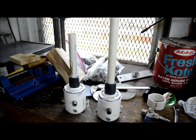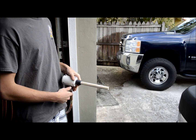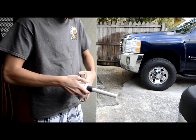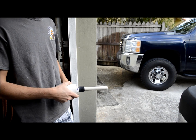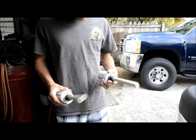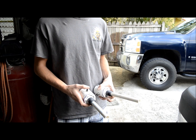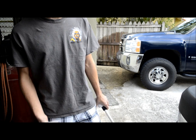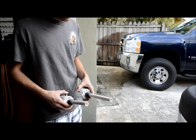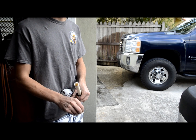Attaching the bells will make them much louder, but here's what they sound like right now at only 40 psi. So that's an A, and that one's a C. Whatever tuning you use is up to you, but I'm personally going to do the augmented fourth because I only have two horns. Different tunings sound better when you have three, four, or five horns all together. Now I've got to go pick up some funnels and clamp them on with hose clamps.